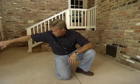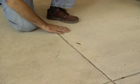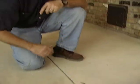And we could have taken it a step further and really divided some of these other areas up, or even done this on a diagonal. But either way, this is a very inexpensive way to put down a fairly attractive screen porch floor. Now, if the homeowners get tired of it later, all they have to do is put a floor joint compound over all of the cracks. Then they can install ceramic tile, quarry tile, or any type of hard surface. Now stay with us. We'll show you more of this porch right after this Around the Yard segment.